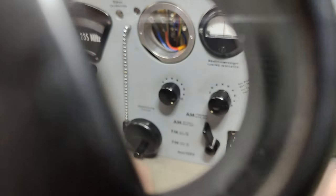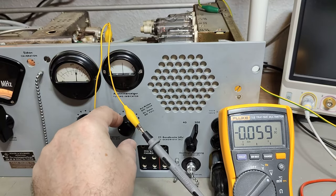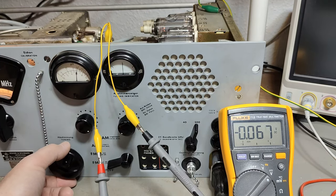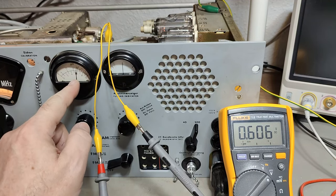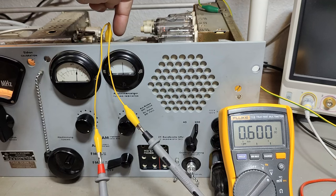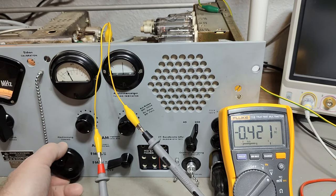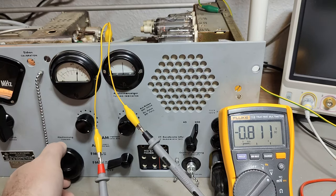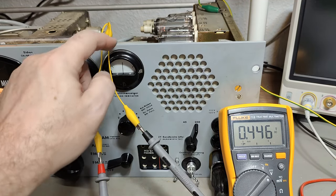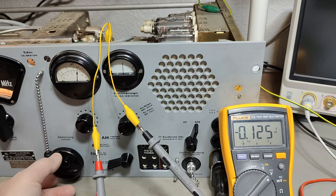So now we can see through the glass - that is amazing. I'm sorry, I have to turn down the volume here because they're playing music and I don't want a copyright strike. But if you look at the signal intensity and the voltage here - this is the tuning indicator - the voltage goes through a resistor to the meter. See the voltage goes up and then it goes down, signal is out. So we do have exactly the right kind of drive signal but there's no indication here whatsoever.